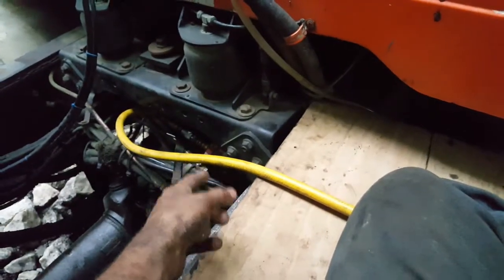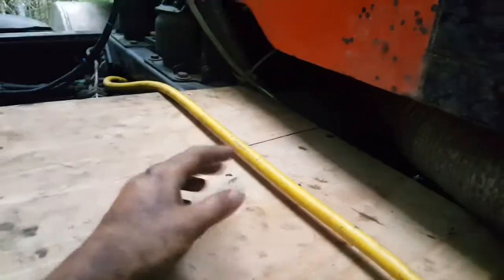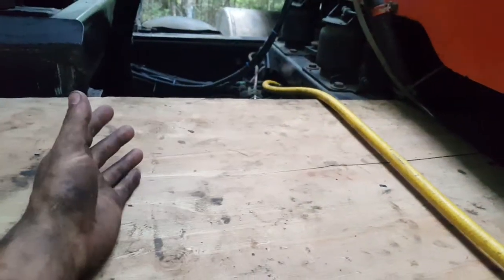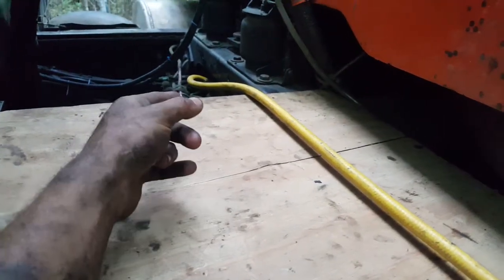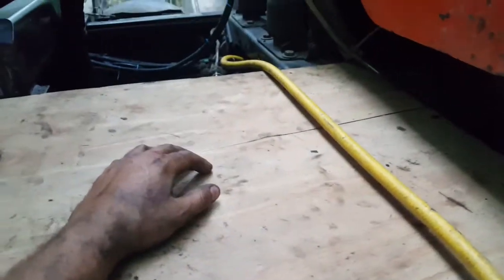And then you connect air to it, push the cylinder in. And fortunately in my case, I'm using the other truck as an air compressor, but you could use a home compressor to push the air in. And then I experimented driving and I get the low range. Now if you want to try, in my case, the opposite, if I want to get the high range, then I have to do the opposite. I just change the fitting. I just change the entrance on the piston. It's really that simple.